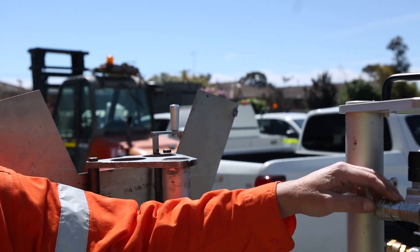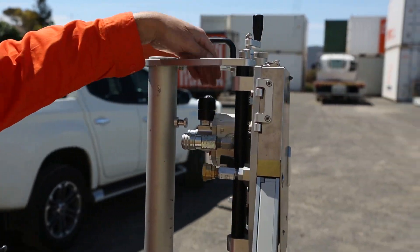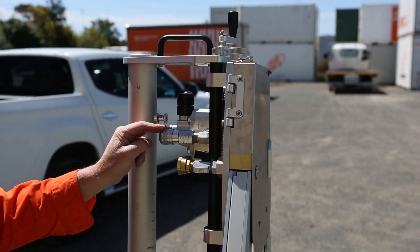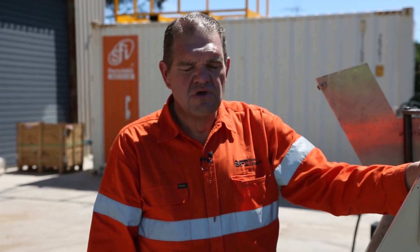This is a hydraulically driven saw. There are two quick disconnects in the back here — pressure and return — and the on/off switch is simply operated through the top here to turn it on and off. This can be driven from a hydraulic power pack, just a 2000 PSI, 30 litre-a-minute unit. Anything that will drive hydraulic power tools and hand tools can be used, or quite commonly many customers use the auxiliary hydraulic connections on their excavator that they used to open the trench in the first place when they're cutting pipe.